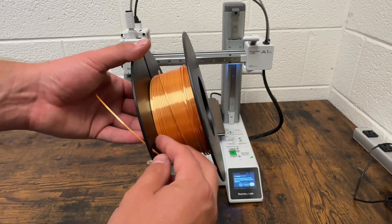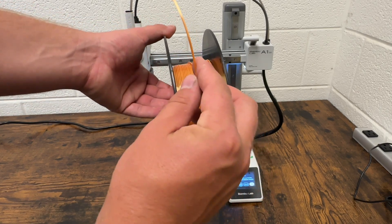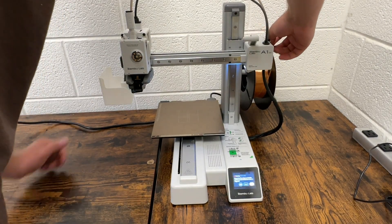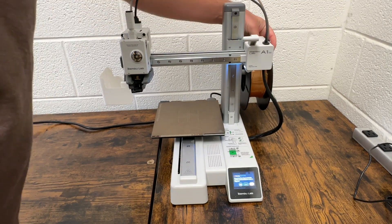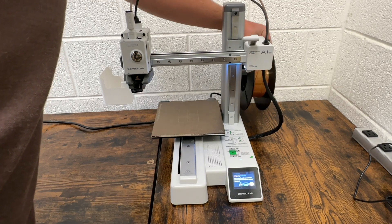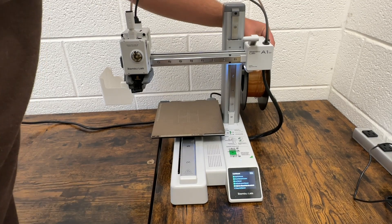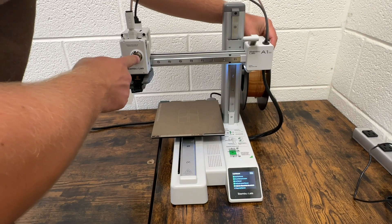When you load your filament, you're going to want to take it out of the hole that it's stuck in, and make sure that it comes from the bottom when you're loading it. Put it on the spool holder in the back, and then there's going to be a small hole that we're going to feed that filament through. Then go ahead and keep feeding it through that clear tube until it gets to the front, and at that point push the filament into the extruder. You're going to see this gear and this window move.